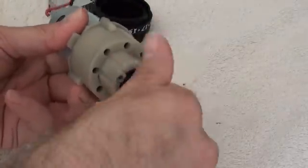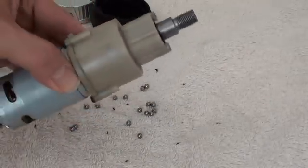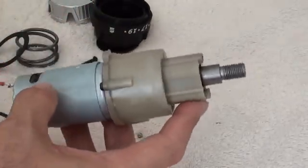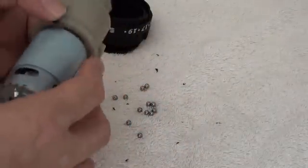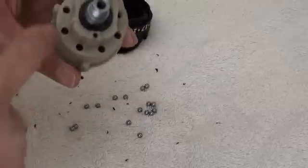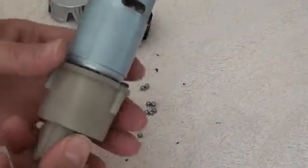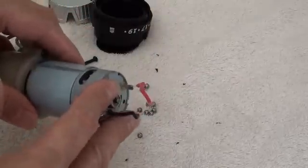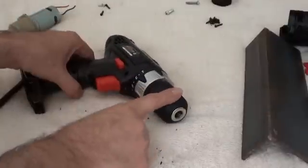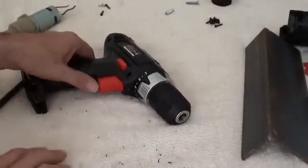You can see the shaft just freely spins now. That is the process of harvesting the drill motors and transmission. In the next installment, I'll demonstrate how to disassemble this, tap out these holes for set screws to lock the clutch, and prep it with leads and a capacitor. Also how to remove a chuck if it's being difficult — like if you have a used drill.